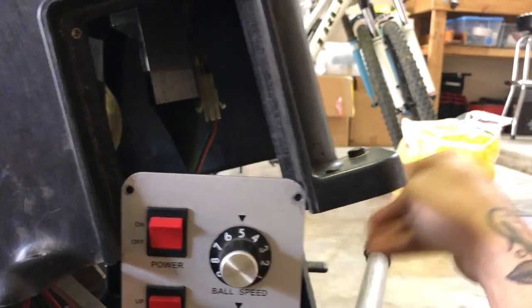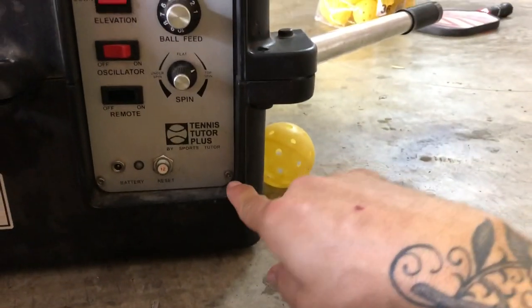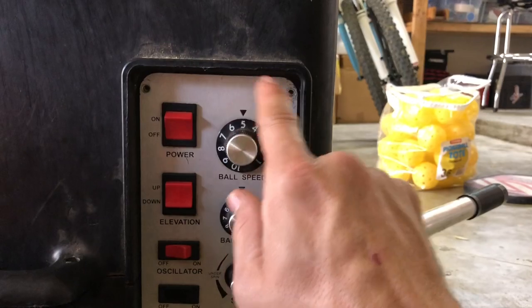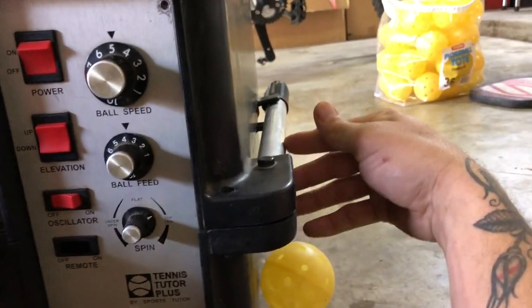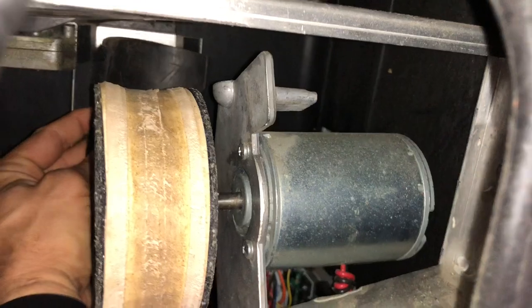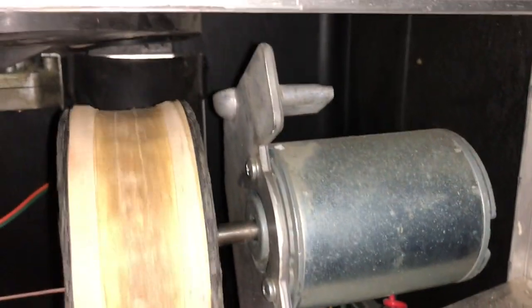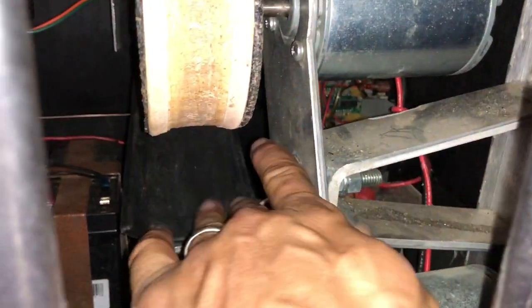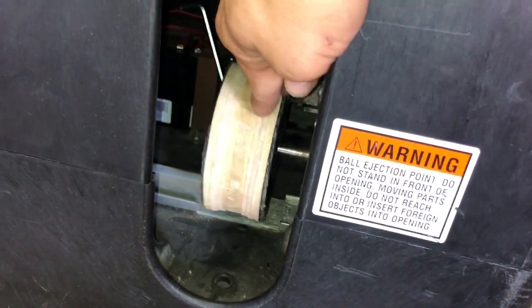Reach back in here, plug in the oscillator, then push this up under the metal and bring this down. I've been leaving two screws out because they're an odd-sized hex — just leaving the two same-sized ones in; it's perfectly stable without the others. Then reach up in here and make sure that chute is Velcroed up nice and high and taut — that really increased my consistency since the chute was flexing every time a ball dropped and entering a different spot on the wheel.